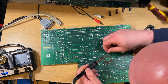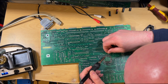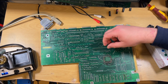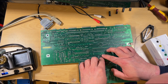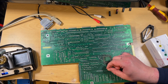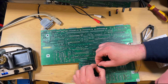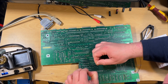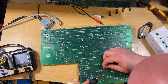So I soldered in another little bridging wire. I'm just counting - it was six in either side, right in the middle, this one at the top. I did go around all these points and test them before, but maybe I missed something, or maybe I just checked the top half of the connection and not the bottom half. There should definitely be continuity between these two points and there isn't. So by using this little jump wire, I'm making sure it's definitely 100% in the right place so we know we've definitely got a correct trace.